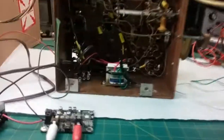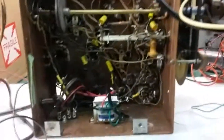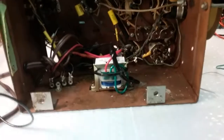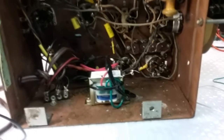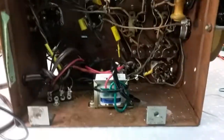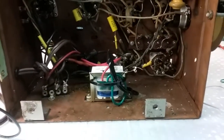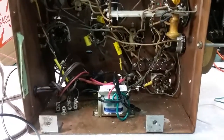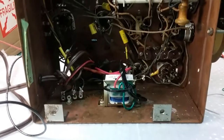I got this radio all set. I can drive it up to 121, 122 volts and stay off that station's problem range. What I did is I put a 12-volt transformer in line - it's a 120 primary, 12-volt secondary. I put the 12-volt secondary in reverse polarity of the transformer in this radio and connected it in series with the transformer. What that does is it subtracts 12 volts off the transformer's primary. So if I put in 122 volts, it actually drops the primary voltage down to 110, and the radio works fine on 110 - it's designed for that.